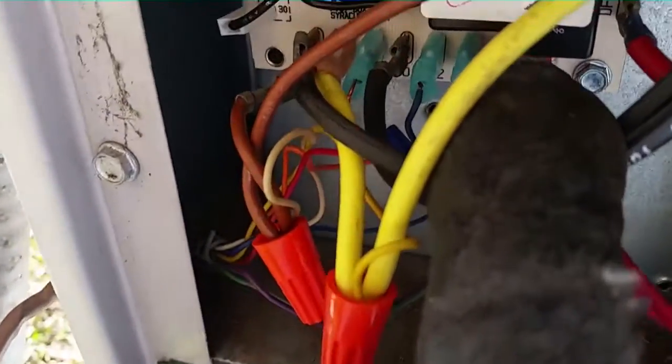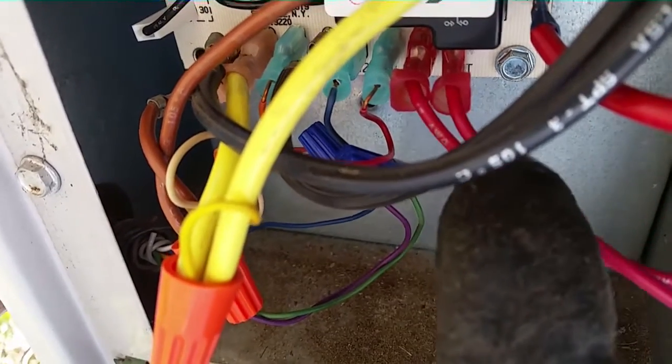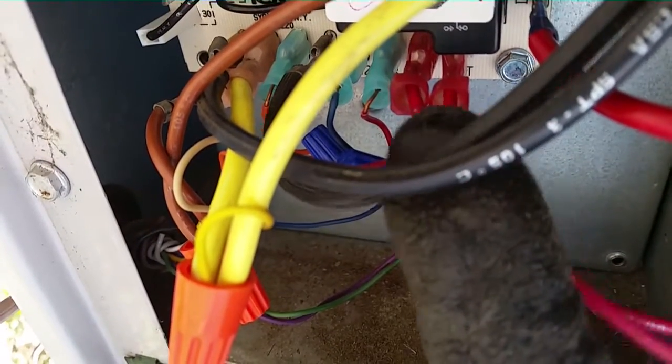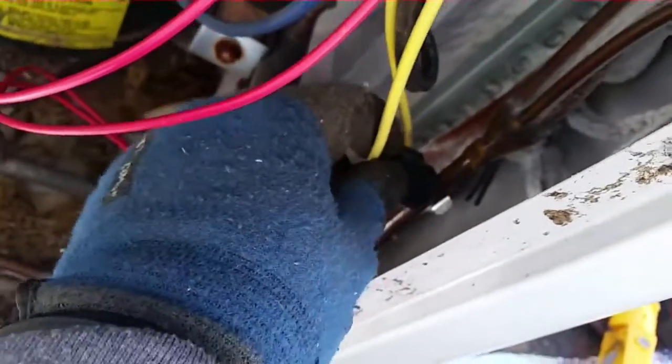These last three are all reds — you can see them in there. The two last wires go to the defrost thermostat, and this one is the red field connection giving us 24 volts. Down here you can see the defrost thermostat — I clipped it on right there.